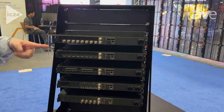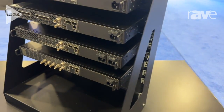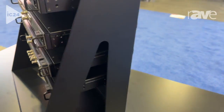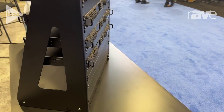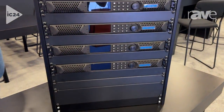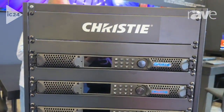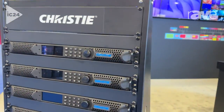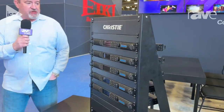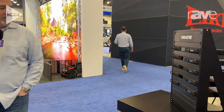These units can be aggregated together to make up either the compositor or our gateway product. QSFP 28s handle the network communication, and baseband ranges from 12G SDI to DisplayPort 1.4, HDMI 2.0, HDMI 2.1, or SFP. The gateway is shipping in the next 30 days, the compositor in the next 60 days, and they're available from Christie Digital Broadcast and Professional Video Group.